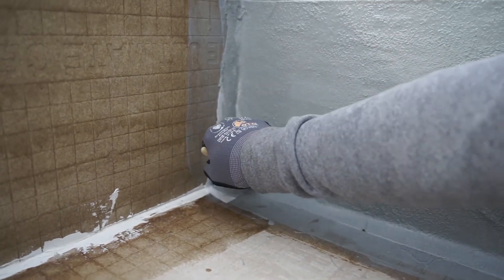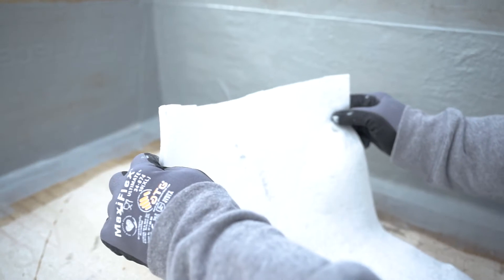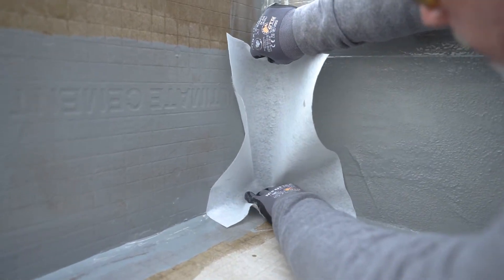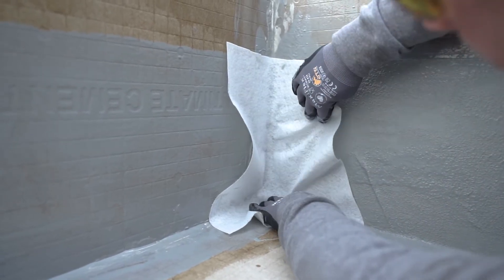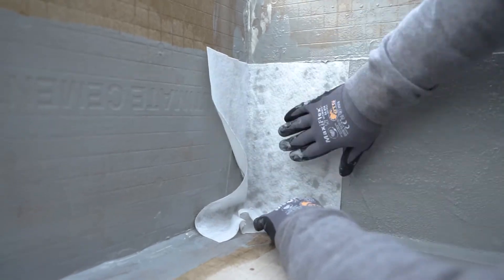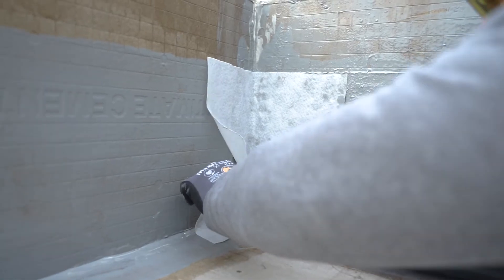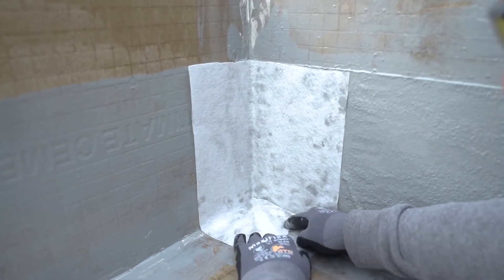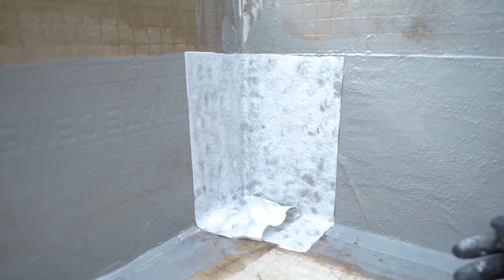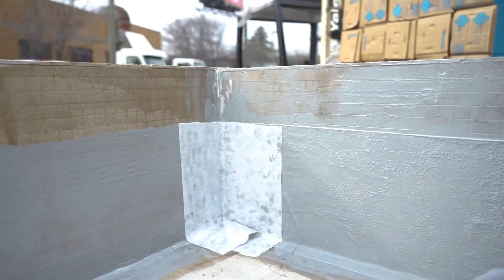So we're doing the corner. I'm adding a little more resin right in the corner. I'm going to install what we call little footballs in the corner — this is where the brush comes in handy because it's a very tight spot. I'm going to install this corner fleece into the wet resin. Press it in and work your way around. Once you have one side done and it's all flat, you can continue on with the next piece. I'll cut the inside piece right here, and once it's fully embedded you can see the gray coming out. Then I'll make a cut and set that back down, ready to install the next piece.